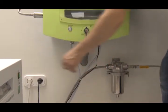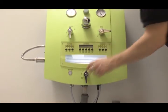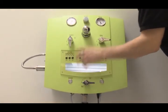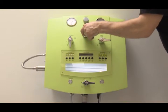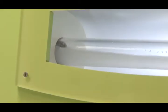Switch on the Habimat and colon hydromat. Set the cleaning lever to on, the stop lever to empty, and the thermostat to very hot by pressing the black button. Now the Habimat must run until water flow can be seen in the pipes.